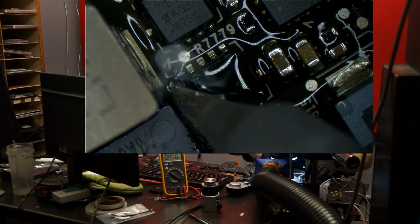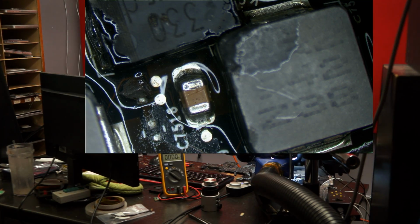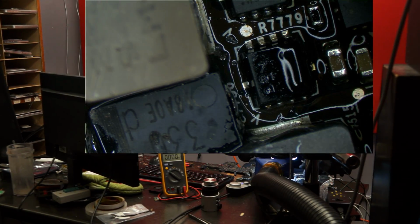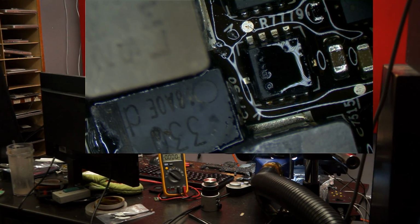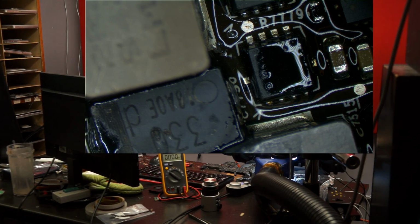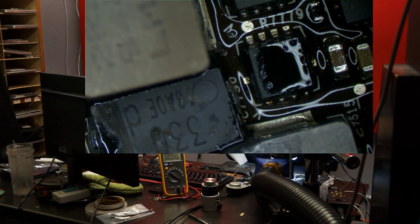The whole thing here, remember, if the consumer comes back for warranty, they're going to ultimately have less confidence in us fixing this stuff. So I really don't think they're going to open up the machine and look in the bottom of it and see that I fit this there and go, I don't like my MacBook anymore because this guy put a different size capacitor there. But this is the long-term fix. This is the long-term solution. Get rid of the tantalum one over there.